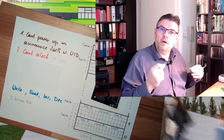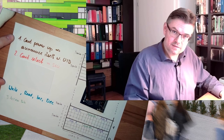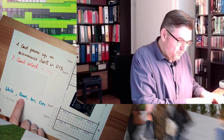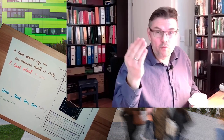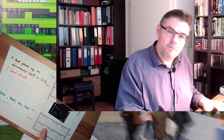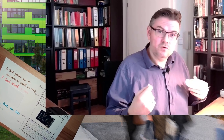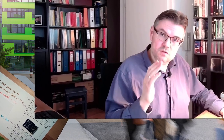Now I don't remember what I wanted to tell you. Ah, yeah, right. If you try to read keys with a read, it will not work. You will get zero, because you have to know the key number A. Key number B can be read. Key number A cannot be read. There is always zero, so you cannot simply read the key out and then use it. This is not working. Security matter. This I wanted also to mention. So this is how this is working.